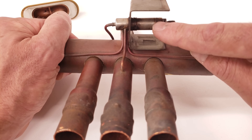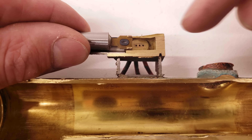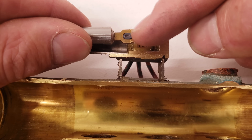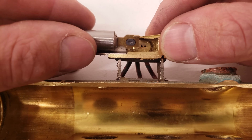On the inside of the pilot valve, it's like a little mini reversing valve — it's the same thing that's on the inside of the main body, except smaller. So here you have a little mini reversing valve with three tubes on a flat brass plate. You have your little rubber channel here that will connect the center to the right or the center to the left, depending on the position of the slide — so it's either going to be here or here.